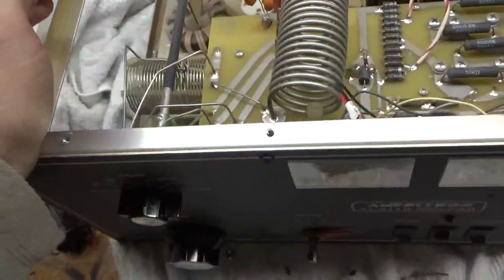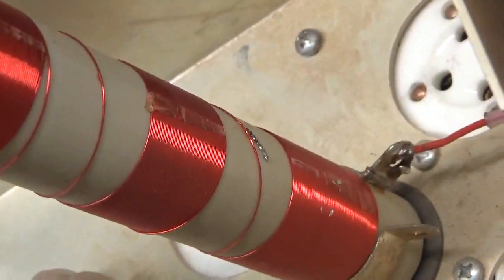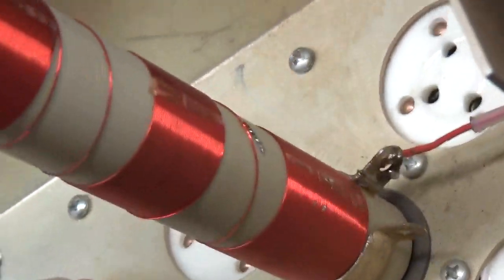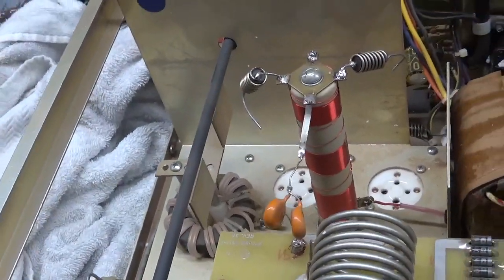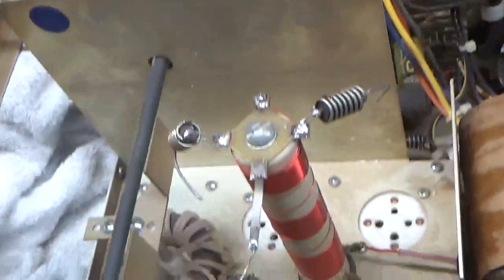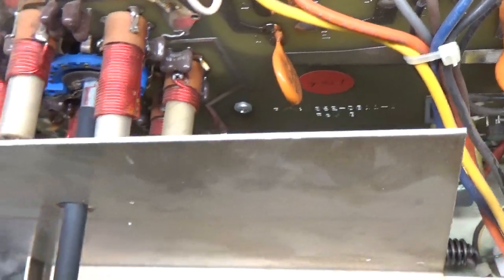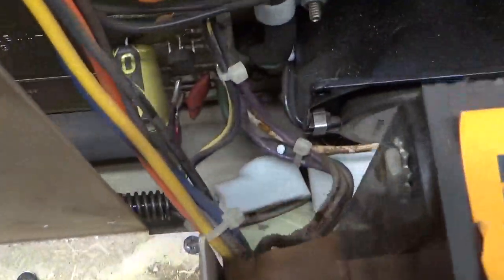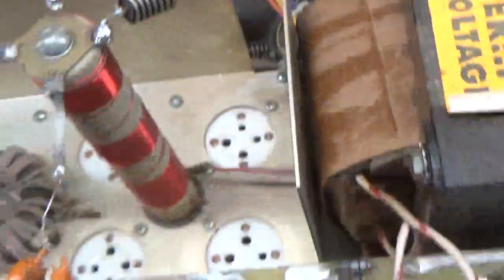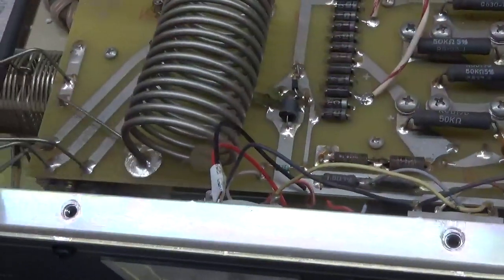The lamps work in the meters. The plate choke opened up in the middle - I'm going to replace it. Someone twisted it and soldered it. I'm going to install a parasitic board. I'm going to ground the grids and put in the diodes in series with the cathode return, the center tap of the filament. You can see the old anode caps - they broke off and they're down there. I'm going to do the bias mod and check the meter protection diode.